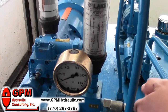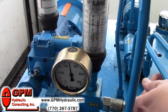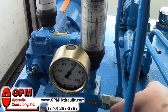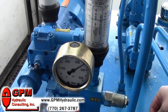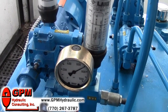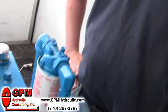As I turn the relief valve up, you'll notice the pressure on the pressure gauge start to rise. I can set that to whatever my relief valve setting is. For this example, let's say 700 PSI is our relief valve setting. You'll notice the flow in the flow meter did not change. That tells me that my pump is good and it doesn't need to be changed.